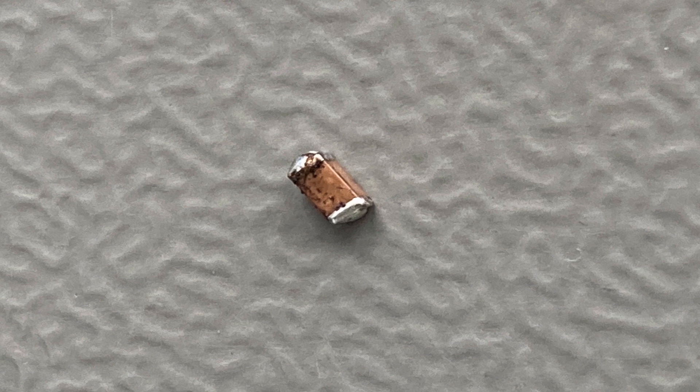So it was time to replace that capacitor. And because I didn't know what capacitor it was, I took a 50uF, because it looked like it's just between a DC rail and ground. So a little bit more, a little bit less — it's not a big deal.